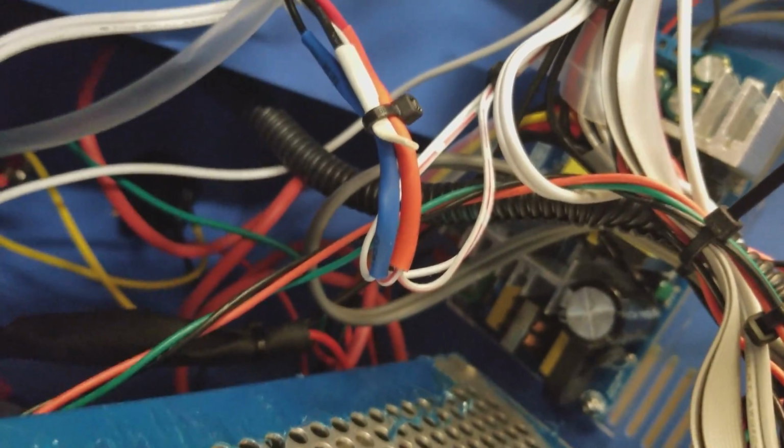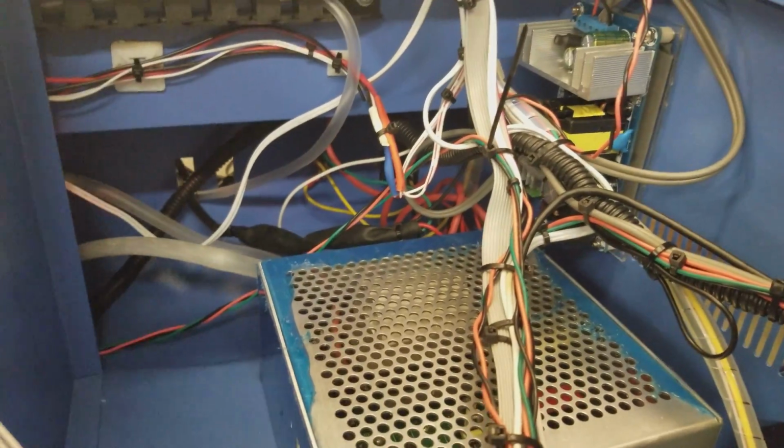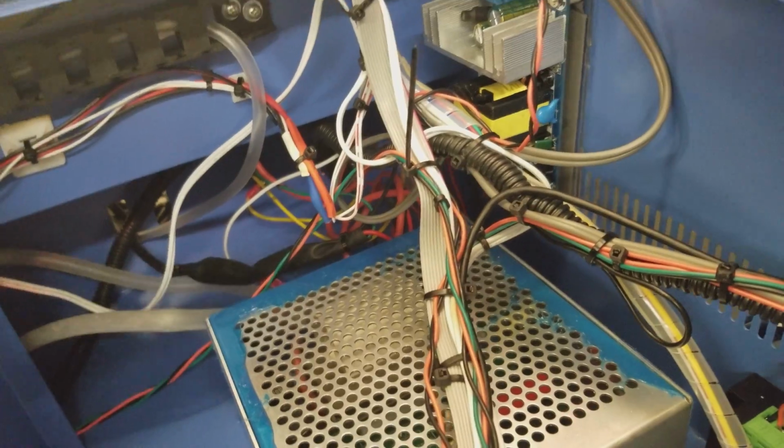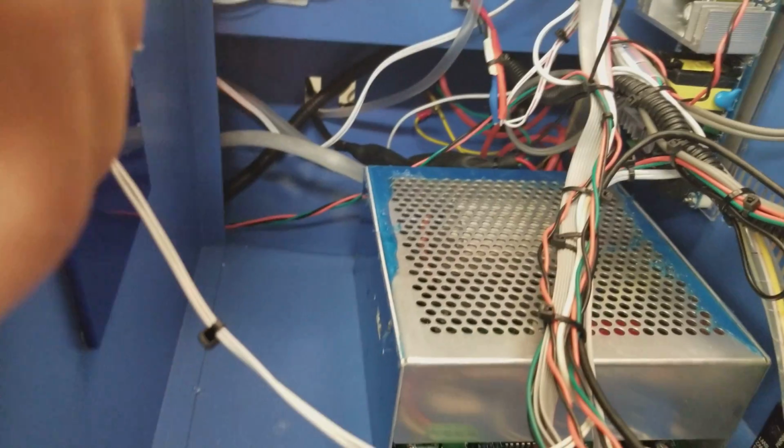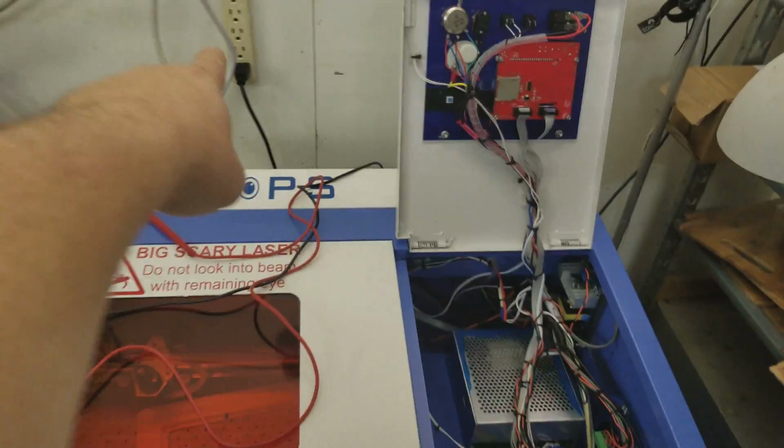The most important thing you can do to make these safe is to go in here on this side of that lug, take all the connections loose, meter them out, make sure you have no high resistance connections, make sure that they're terminated properly, check the crimps, make sure the wire won't pull out of the termination, out of the wire terminal, and put it all back together, and make sure that you have good, decent mechanical and electrical connections there at that junction where all of that ground stuff comes. And then reference it and meter a few places on your chassis to make sure that you have continuity to ground. If you do, that means effectively your machine is grounded.